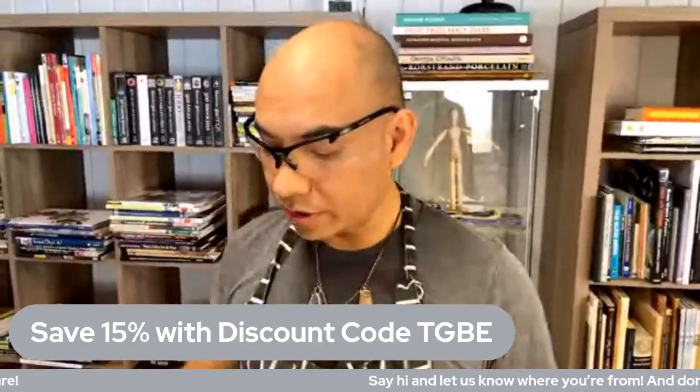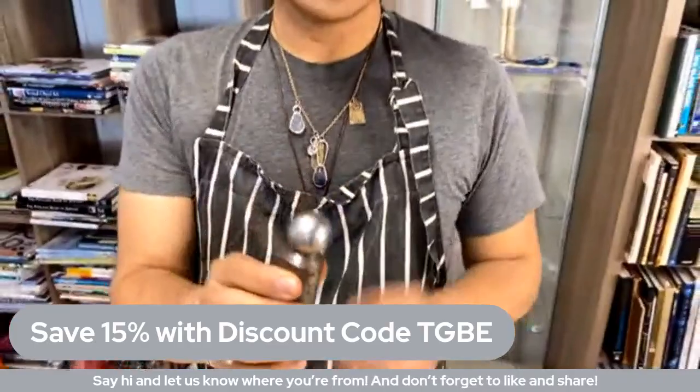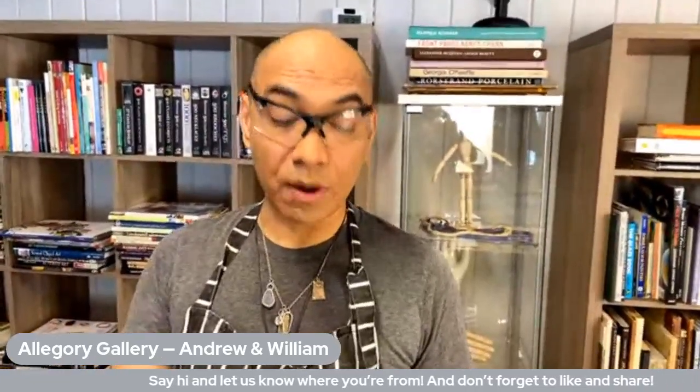Now, one of the things we're also going to do is you have a punch. This is a dapping punch. And this one I got off eBay. So it's a little bit well-loved, aka rusty. So what I did is I took varying grits of sandpaper and I just smoothed this over, going from the lowest number to the highest, because the lowest number is going to be the roughest and it's going to take the material off. And the higher the grit number, like 1,000 or 2,000, it's going to polish it nice.